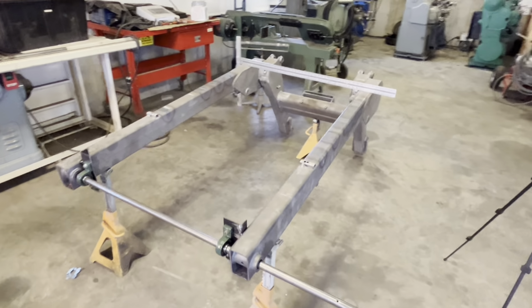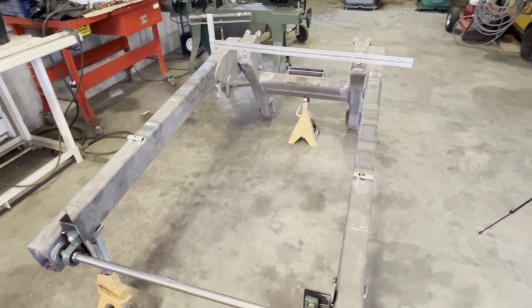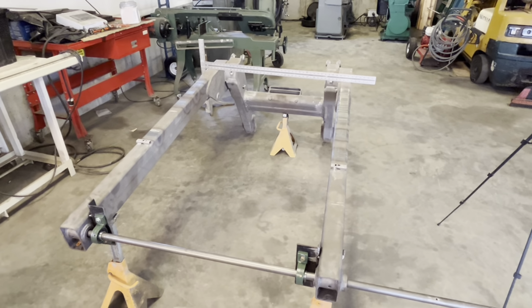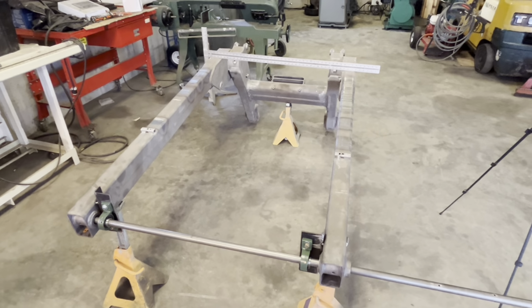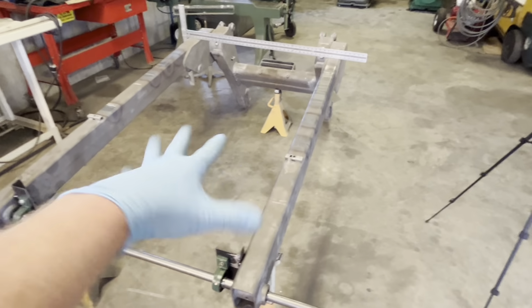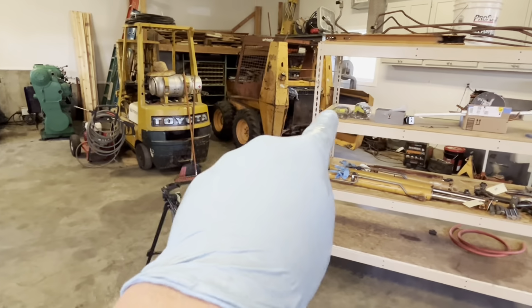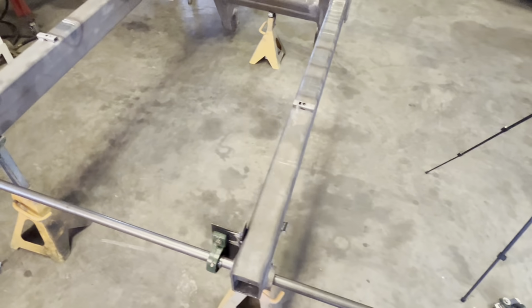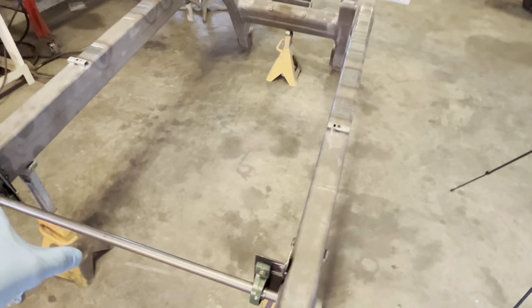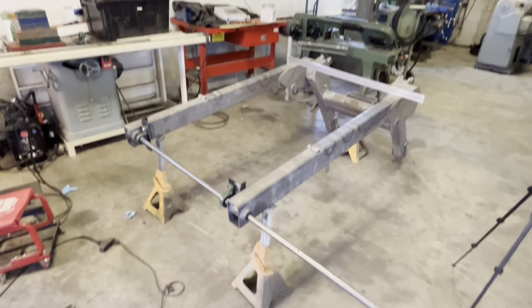So what I'm thinking is I'm gonna spread the back, put a block in it, and maybe overspread it to see if it'll hold. I got it set up on 3 points so it's not twisted or anything. But I need to bore this at the same width that it's gonna be on that machine, because it would probably be too tight on the insides if I spread it apart getting it into the frame. So it's never easy.